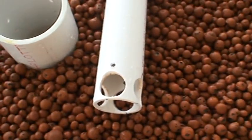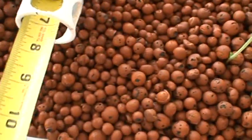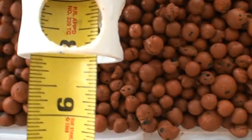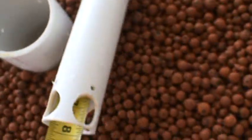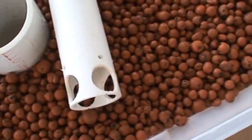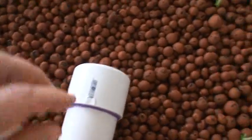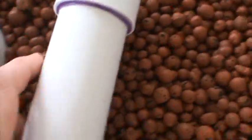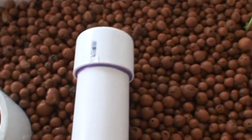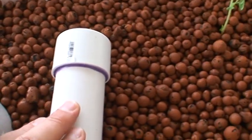I'm going to pull out the tape, go into the inside of this bell, and find the lip where the cap sits on. Measuring that — it's exactly eight inches. That length of pipe — from what I've found, eight inches with a seven and three-quarter inch standpipe — is going to only leave a quarter of an inch up at the top, which in my estimation from what I've read on the aquaponics wiki and through experience is too small.